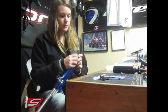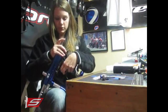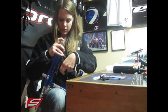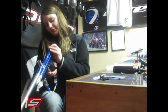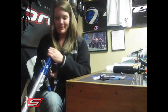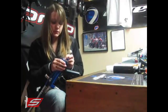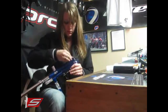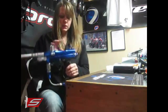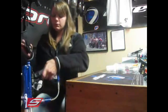So we're going to go ahead and put this back together and see if we can air it up and fix that problem. You have to hold down the trigger so we can try to drop that sear and get this back in there. There we go. Put this piece back on the pin so that stays in place, drop that pin back in, and we'll go ahead and air it up and see if that fixed the problem.